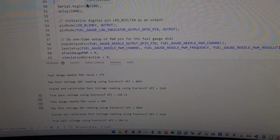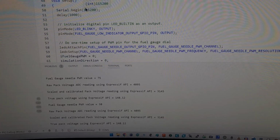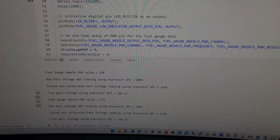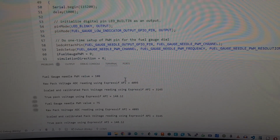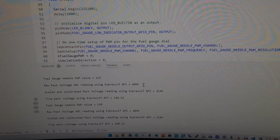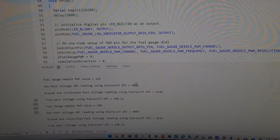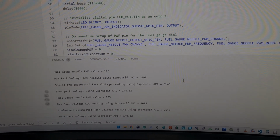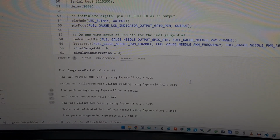So it turns out when I was testing the board, I didn't reverse the D plus and the D minus from the connector to the UART chip. It was correct. And I can't believe that my serial port debug statements are now coming out. That's pretty cool. Now, what I did notice is it looks like I'm getting the maximum value on the input pin even though the power supply is off. So maybe I jiggled a wire and I'm now getting a full 3.3 volts on that pin. But that's one more good thing. And as far as I know, I only had one bad wire on the whole board. And that never happens. Never, ever, ever.